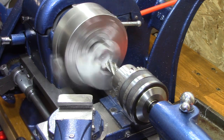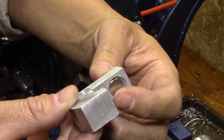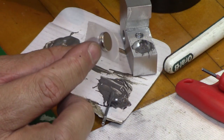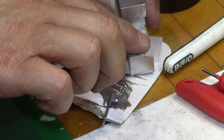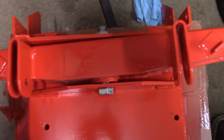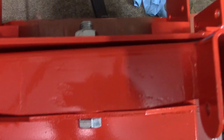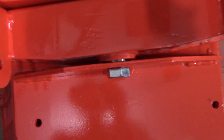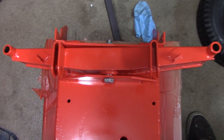I chucked up an end mill because that'll give me a flat bottom, put the bottom in there, and now I'm going to glue in that rare earth magnet. I didn't have room for two of them, so I'm just going to use one. One of the things I'm trying to get better on is giving guys credit when they helped me out — there was a guy who gave me the idea to tape the magnet on there so when you put it on your bedway it would be perfectly flush. I totally forgot his name. Looking at the reassembly, there's a little bit of a gap in there with some steering back and forth. It looks like about an eighth of an inch, so I'm going to make a bushing on the lathe so there's no play.